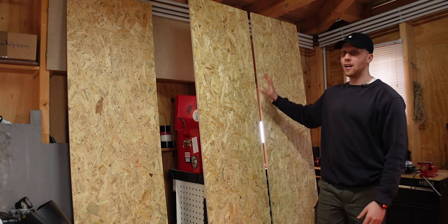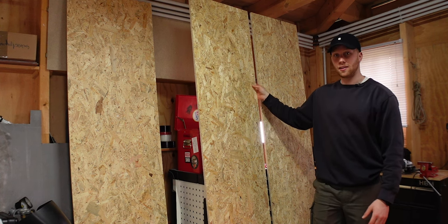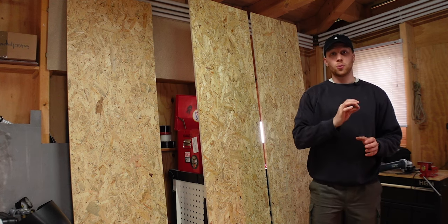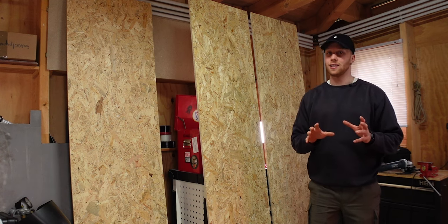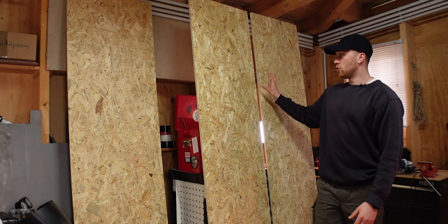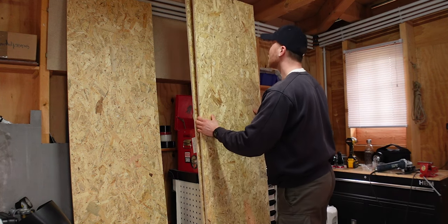You need at least a top plate. I got two because they only had 16-millimeter-thick plates. From my experience with the wooden workbench, I had a 22-millimeter-thick top plate and it felt a little too thin. So what I would recommend is a plate that is as thick as your frame, but at least 30 millimeters. Since my hardware store didn't have that thickness, I went with two 16-millimeter plates screwed together, which equals 32 millimeters — not ideal because it sticks out a little bit below the frame, which adds another step.